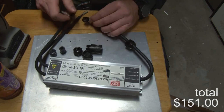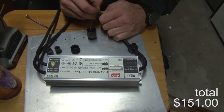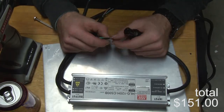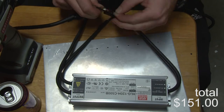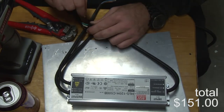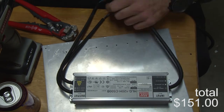These AC connectors are another thing you have to buy in packs, so the first time is an added cost, but on the next build you'll already have one. They're gland fittings that screw together — you screw both the driver wire lead and the plug into the main piece using a micro screwdriver. They're IP65 waterproof, make a really clean finish, and are removable. They were a bit complicated — about four or five pieces — so I'll look for a simpler two-piece version going forward.